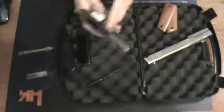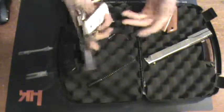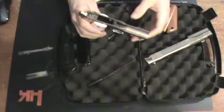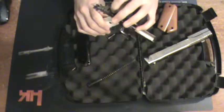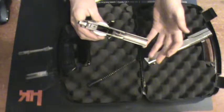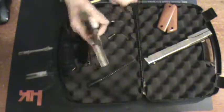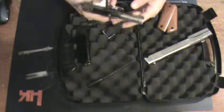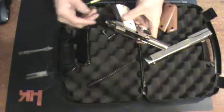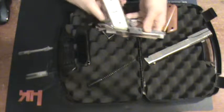Now besides that, everything else in the lower — as you know — is the safety. Everything works fine: the rear safety, the sears. One thing I will say is I notice in the action, the rear sear seems to catch just a little bit. I'm talking a ridiculously small amount, where if you pull back the slide really slowly you'll kind of notice it. I think that's still common in 1911s. Not really a big deal. Eventually I might swap out the sear, but it's kind of iffy. We'll see.